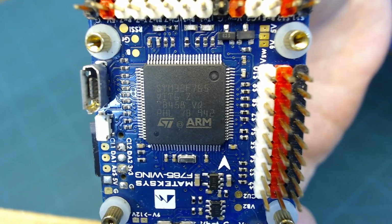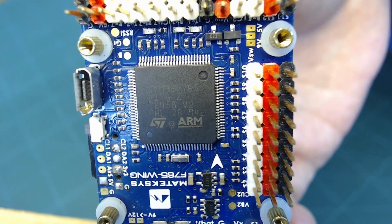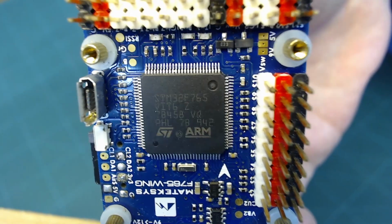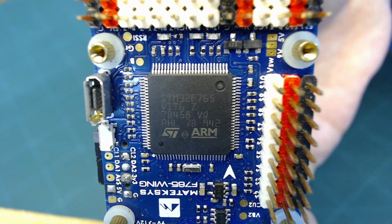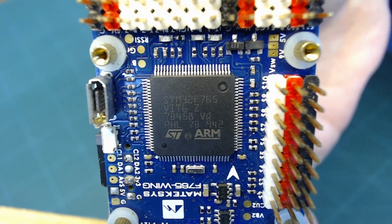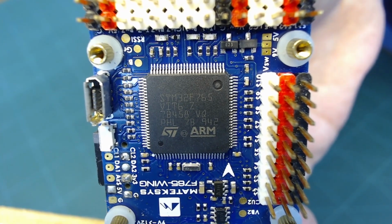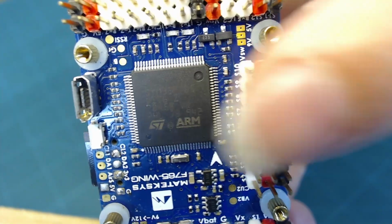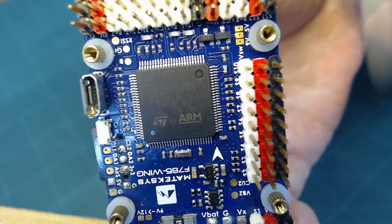So there's various inputs and outputs on here. Another serial interface is the IIC, or I2C, which you may see referred to in any of these references, which is just a two-wire protocol. It's similar to a UART, but it's different in how it works. It's more like a bus. You can connect multiple external peripherals or devices to an I2C bus, as opposed to a UART, which will connect to a single device. So you have a number of UARTs available depending on what chip you have, and the more UARTs that you have, the more devices that you can connect to it.